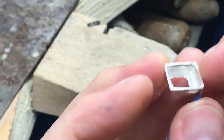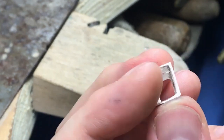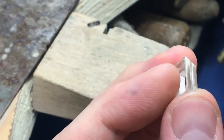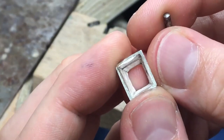Then cut the other half of the daylight hole — because it's joined together by the claws — and then put the last two claws on. That's how I proceed because it's going to be cast, and after casting you have to buff the sides and polish. Consider that castings shrink and you'll need more filing.